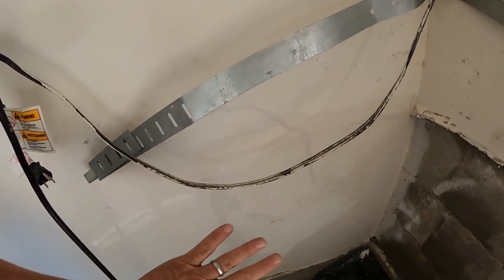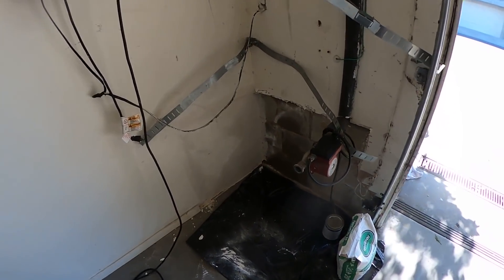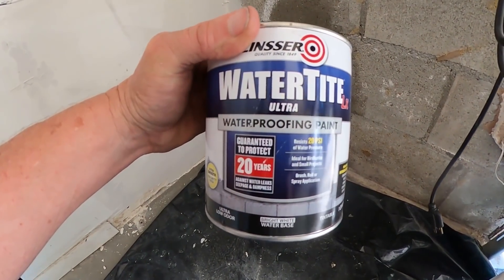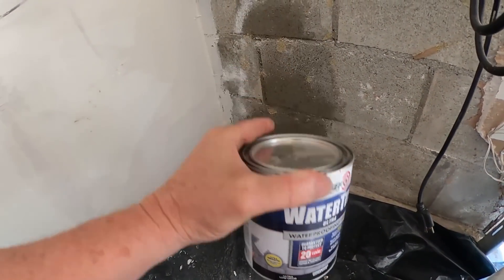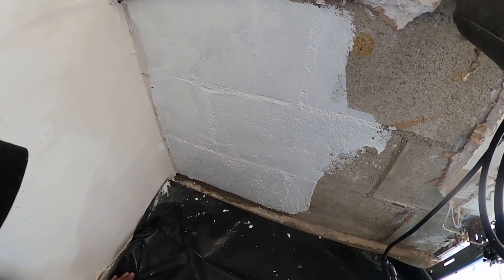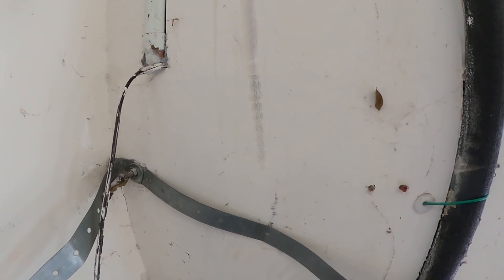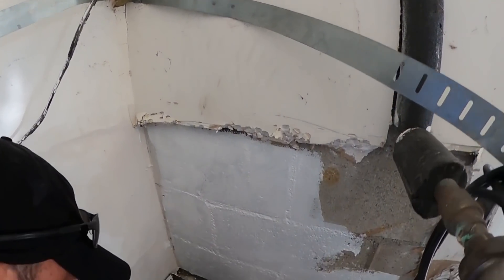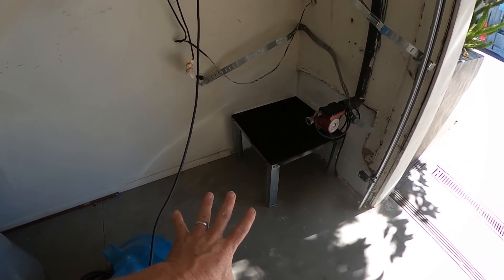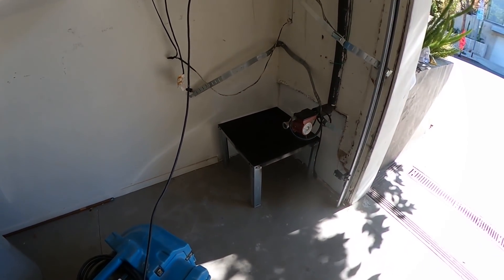Raul's got the 20-minute compound — we're cleaning this up and then adding our Zinsser waterproofing. We're going to apply this Watertight Ultra waterproofing paint, which is really good for cinder blocks. I never recommend putting sheetrock over cinder block — it's just not working. We've pushed air for at least 45 minutes, we've got everything dry, and we've got the coated water heater stand. Now we're going to reinstall the water heater.